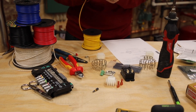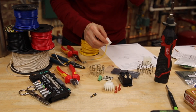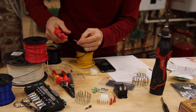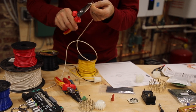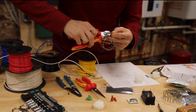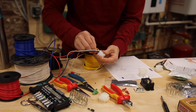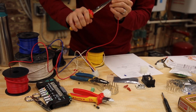Making the wiring harness is a pretty straightforward process. I started with the black and yellow wires, which connect to the 240-volt hot wires from the breaker and offer the power supply for the fan coil. The wiring harness comes with small male connectors that are pinched onto the wires and then slip into each connection of the 12-pin connector. The next two wires I made up were the white and blue wires for pins two and three - these are how the motherboard for the air handler communicates with the relay board. For the ID wiring, I used two lengths of red wire connected to pins five and eight, leaving the ends disconnected so I can solder in the 270k ohm resistor as the ID later.